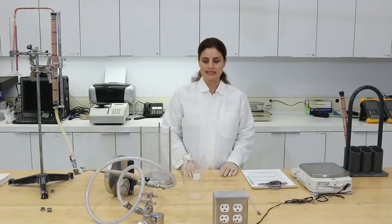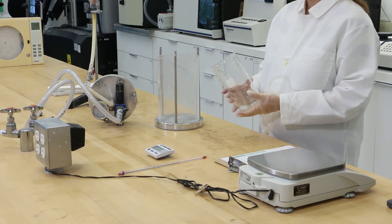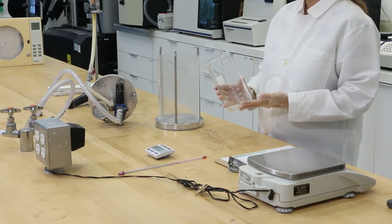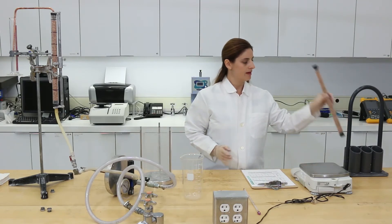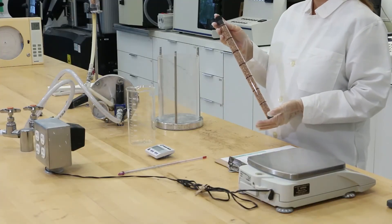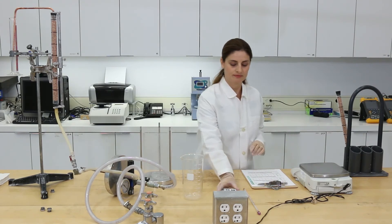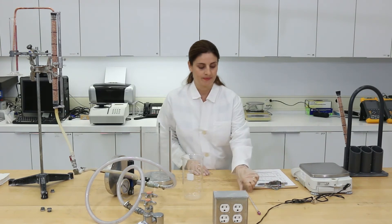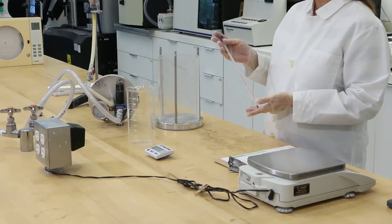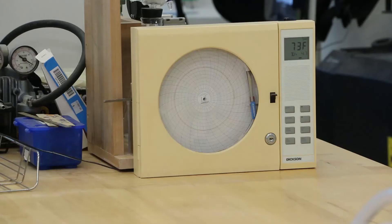In addition, you will need a cylindrical container approximately 80 mm in diameter and 175 mm high, which will contain 500 grams of grout, a column filled with granular material, a stopwatch, a balance accurate to within 0.1 grams, a thermometer accurate to within 1 degree Celsius, and a relative humidity meter accurate to within 1%.